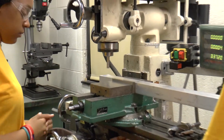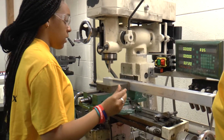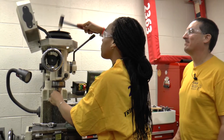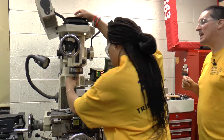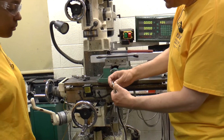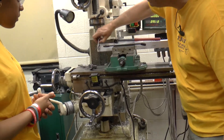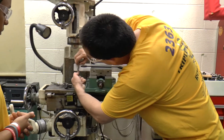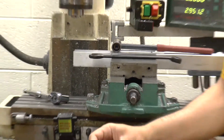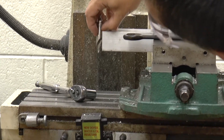Now the next tool you need is this one, so you can swap your tools out. You may have to drop the table down to get it out. You want to put it in there until it's just about that deep, because you want to have as much sticking out as you can. When you drill down in, you want this end to penetrate through the bottom before your tool bottoms out. So you're going to have to cheat it down a little bit.